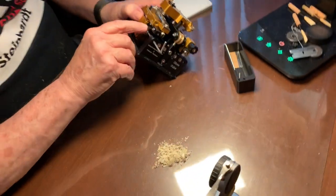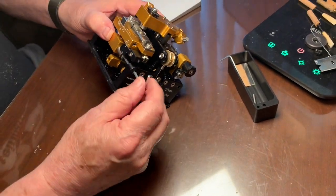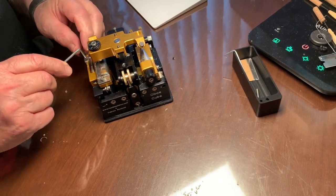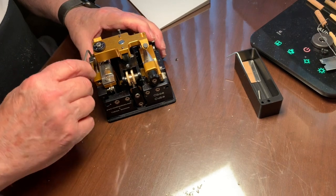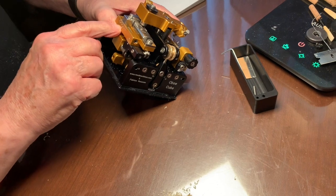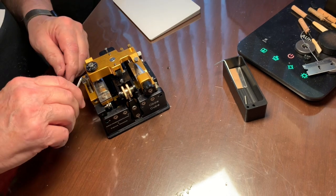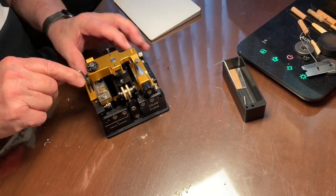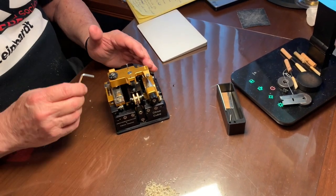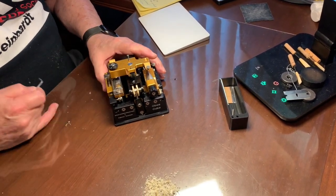This is the tip. It shows the tip angle here. I turn this and I'll move this back and forth. Now, if I want to change the shape or the length of the scrape, this is a set screw. So here we're going to take the set screw and loosen it, turn the rod here and move the length of where the scraping starts. So you have two areas that you have to balance for the back. But the advantage is if you want to do just one, you can do it, and then you can check the other. You can move them back and forth. You can always go back to where the numbers are set up to begin with.